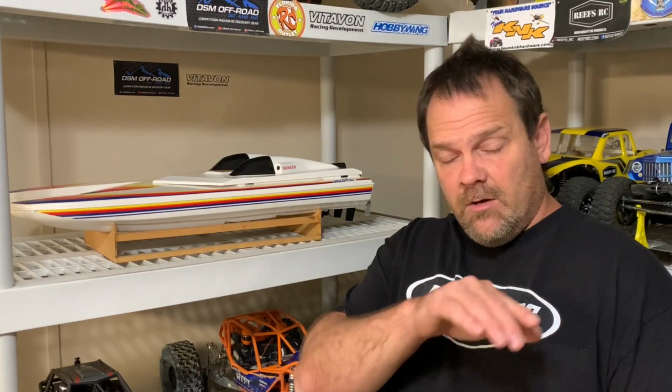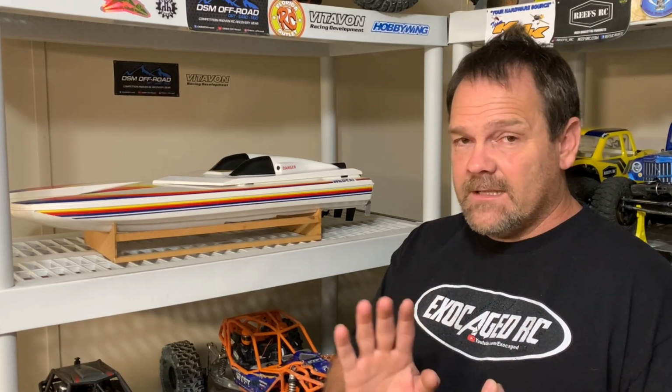It just simply goes. I did talk to Gary, and Gary has on order the 880 Hobbywing ESC, so we can actually put 4S on it. Now, remember, the motors are in series. So if you put 14 volts through 2 motors connected the way these are, each motor is getting 7 volts. So it splits it. Now, if one motor stalls, you almost get a full pass through of the stalled motor, almost like a dead short, but not quite, to the other motor. So the one free motor is really going to be turning.